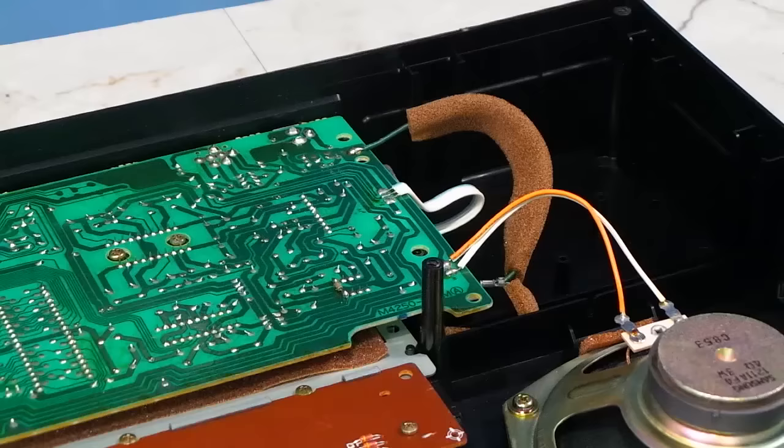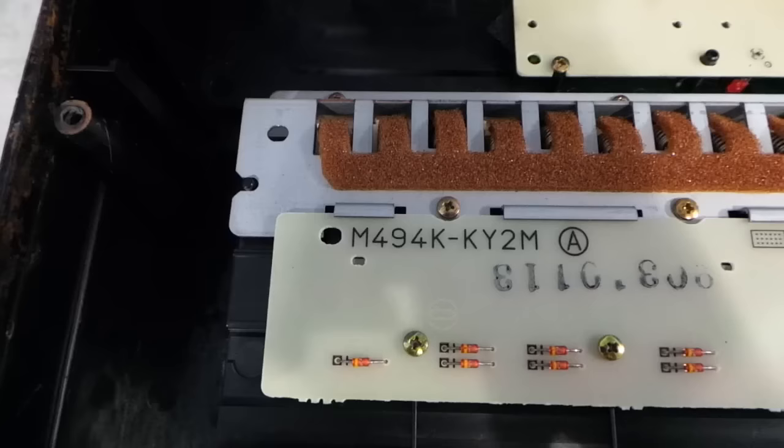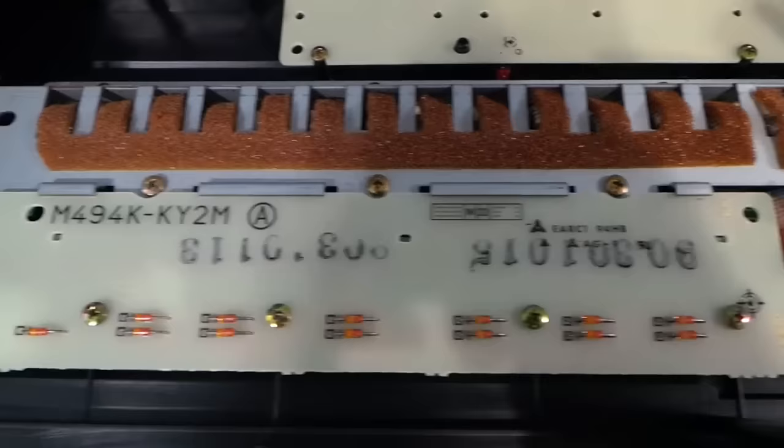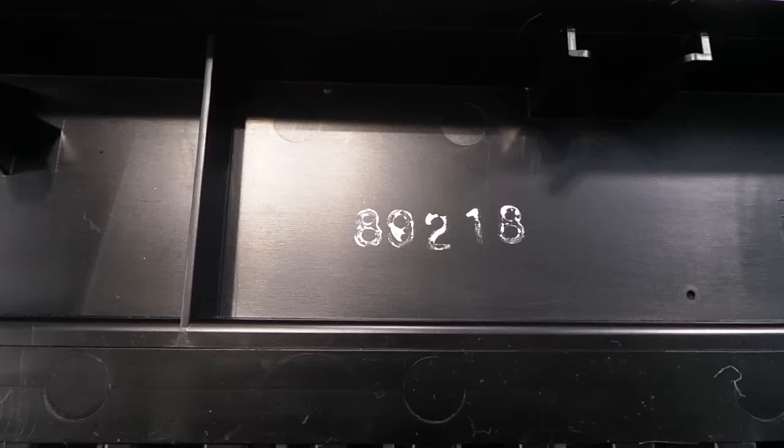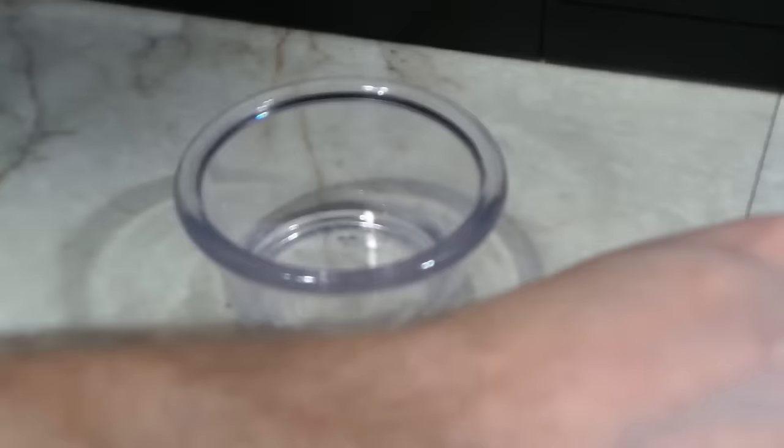I'd like to get a look at the logic board, but all of the wires are soldered on and there's no easy way to remove it. Part of what I'm trying to figure out is what year this keyboard was made. There were no markings anywhere on the outside indicating a year, and a Google search came up inconclusive. There's a marking that looks almost like a date code suggesting 1994, which is plausible, but the date code on the plastic suggests 1989 — meaning this keyboard is about 27 years old.